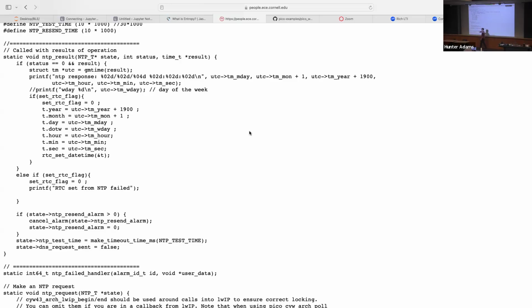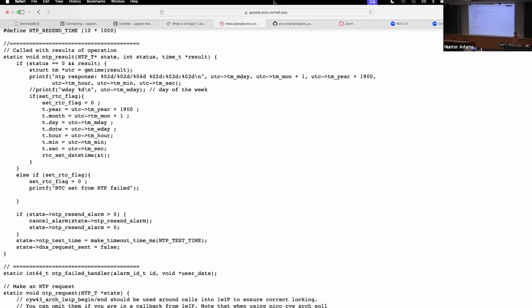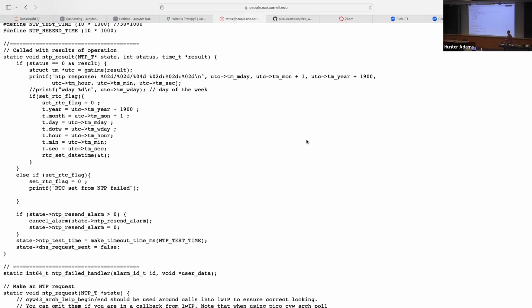Do you know the drift of the RTC off the top of your head? 2.56 seconds a day. Yeah. 15 minutes a year, which suggests that perhaps every now and then you want to go ping that NTP server again to update your time. How often? I don't know. It depends how accurately you need to. Well, also human uptime in a year. Sure.